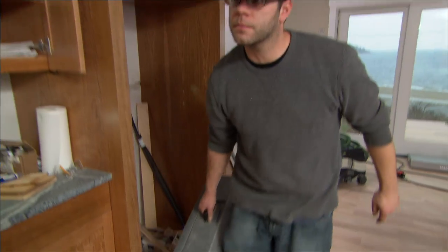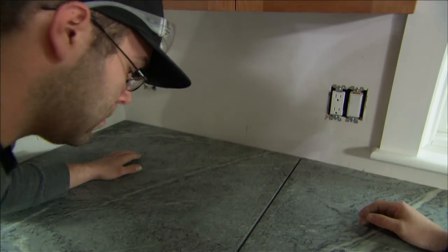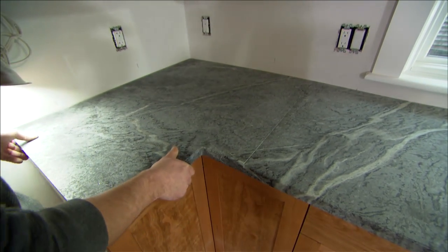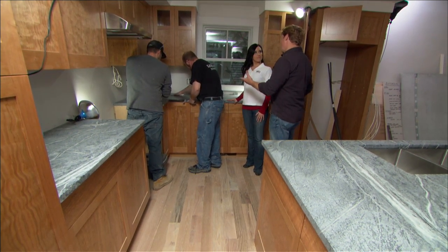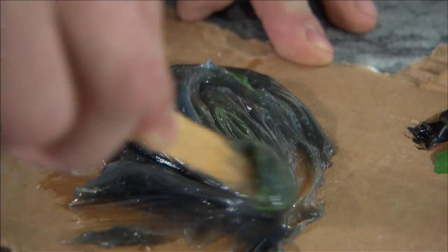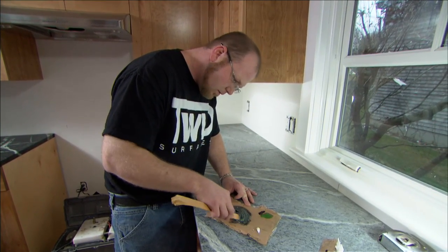Our kitchen countertops have arrived, compliments of Alyssa St. Jolais. The material is Saratoga Soapstone in the color Stillwater Gray, coming from Brazil. We have four pieces, which means one seam over in the corner — and the hallmark of a good installation is how well you do on the seams. The trick is mixing the epoxy with different colors so the color blends in with the background and isn't popping out at your eye.